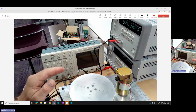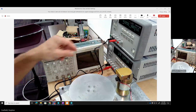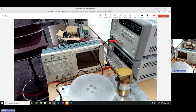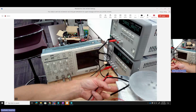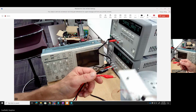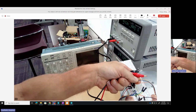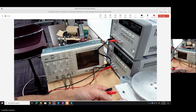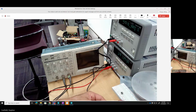encoder. So we need to bring 5 volts to the encoder. So I'm going to jump to the power supply below. I just turned it on. I'll take the 2 leads, bring up this power supply here. And I'm going to connect them to the leads, in this case, the orange, which is there, and then the brown. So that's going to be my 5 volts and ground. So I'm connecting them. You can't see me, I'm off the screen, but I'm connecting those two.